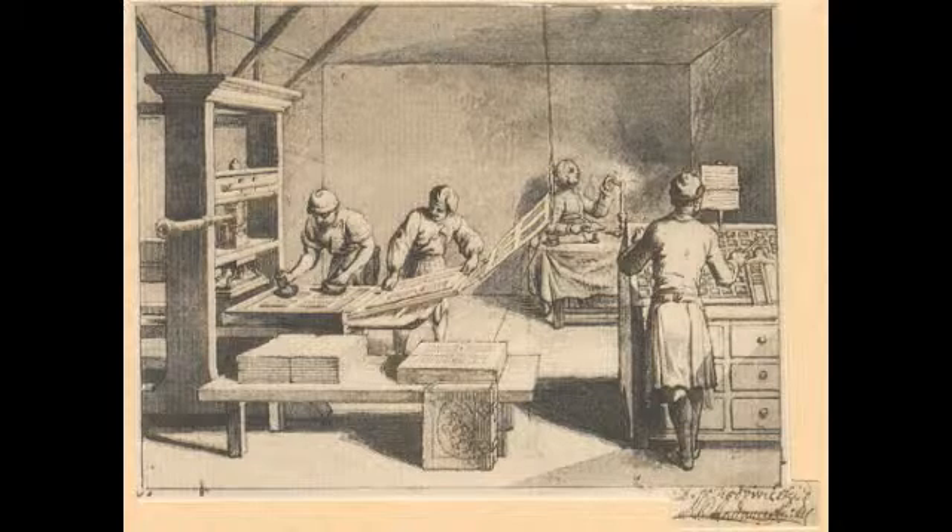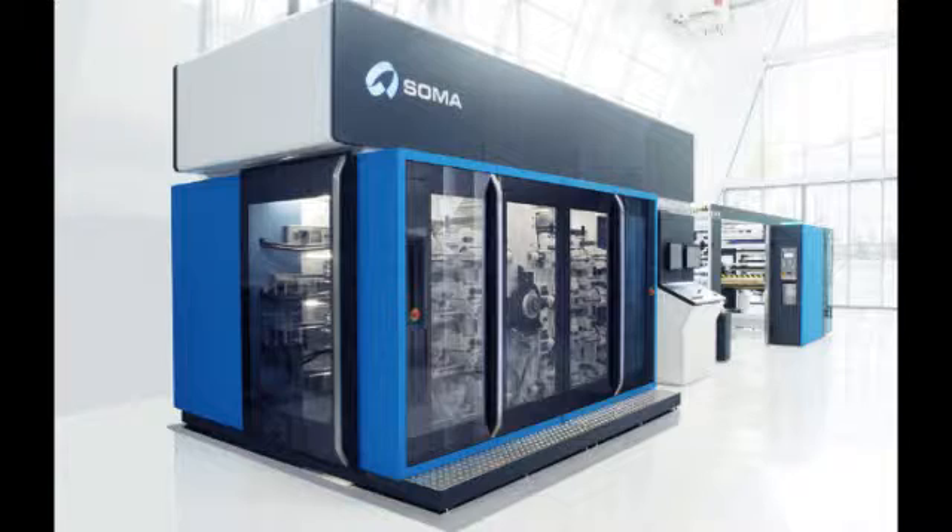The unit is equipped with a dual membrane filter, keeping the environmental burden to an absolute minimum. The membrane unit separates photopolymer from the washout water. After addition of absorbed gelatin, for example, the photopolymer residue can be disposed of as standard solid waste together with household refuse, and the recycled water is reused without adding any detergent. The second method uses a computer-guided laser to etch the image onto the printing plate; such a direct laser engraving process is called digital plate making.